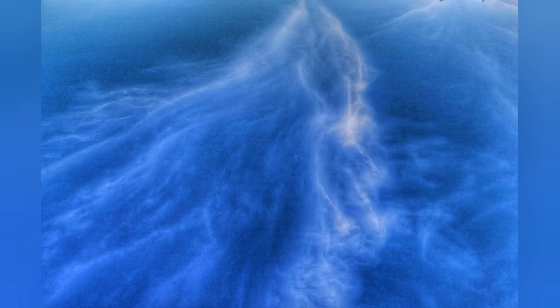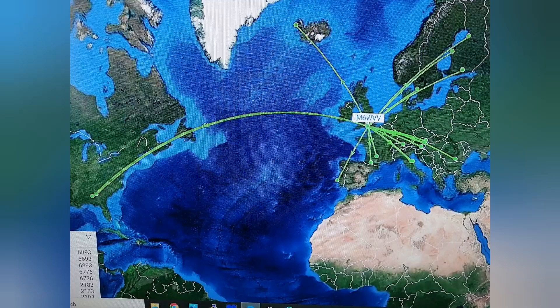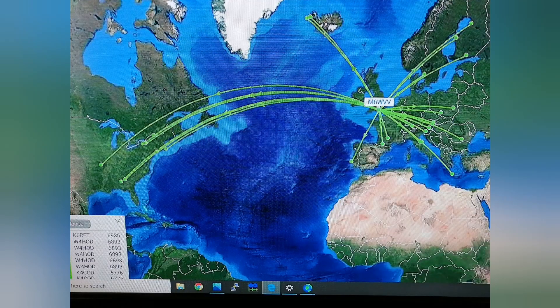Don't go just yet — we're going to compare that WSPR map with one from my delta loop antenna to see how well the ladder is working. Here we have the WSPR map from the ladder antenna showing where the reception reports were coming from, and here's the one from the delta loop antenna. As you can see they're very similar — the delta loop maybe pushed a few more signals into America slightly further up the coast, but distance-wise very, very similar, and across Europe almost identical.